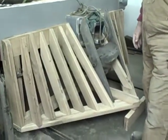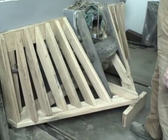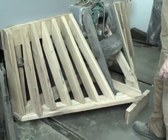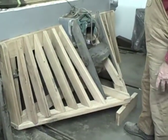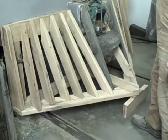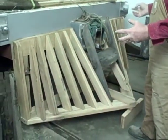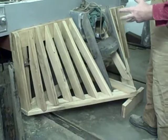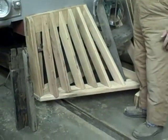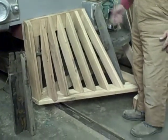What we've done is, working from photographs available covering a 100-year span as posted up on the wall, reconstruct it as it was in the early part of the 20th century. This is all solid red oak. All of the pieces that attach to the frame are attached with lag bolts, and all of the pieces that attach to the metalwork are attached with actual square head bolts. All of the individual teeth — every one of them — has to be cut at its own unique angle in order to be restored.